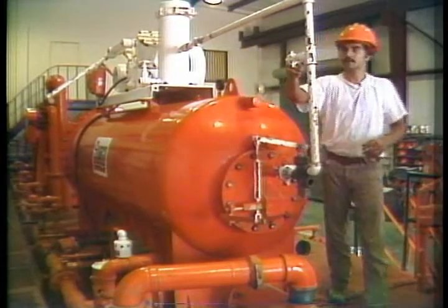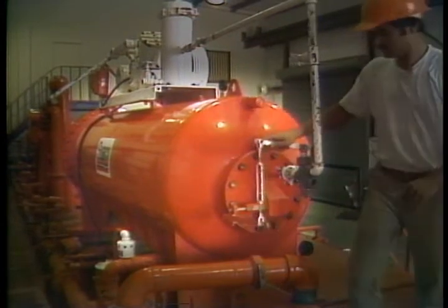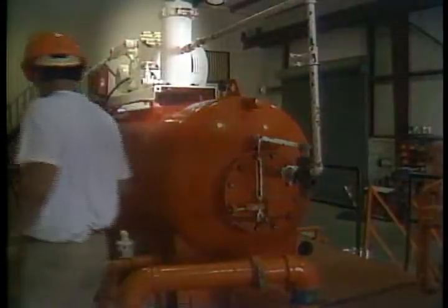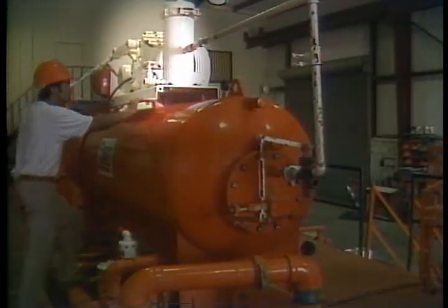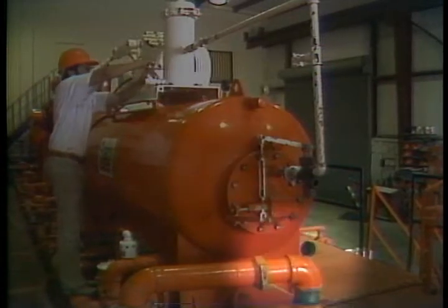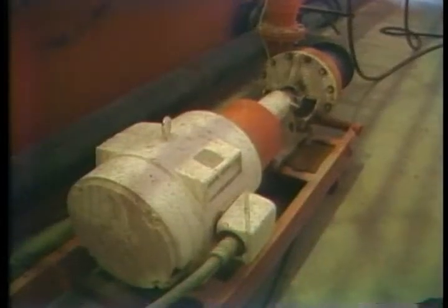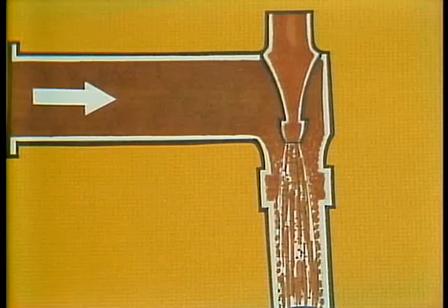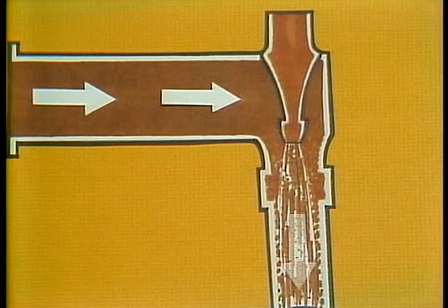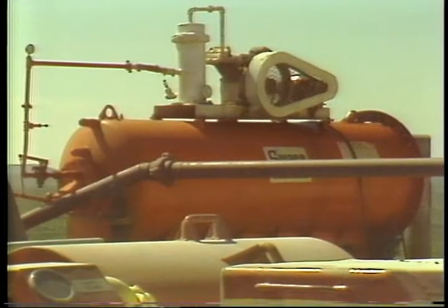It's got just three basic systems: a horizontal cylindrical tank which processes the mud, a vacuum pump that removes the entrained gas and pipes it away, and a jet nozzle that's usually powered by a centrifugal pump. The jet creates a low pressure area in the discharge pipe to unload the tank. This SWACO degasser, which most of our rigs have, can handle up to a thousand gallons of mud per minute.